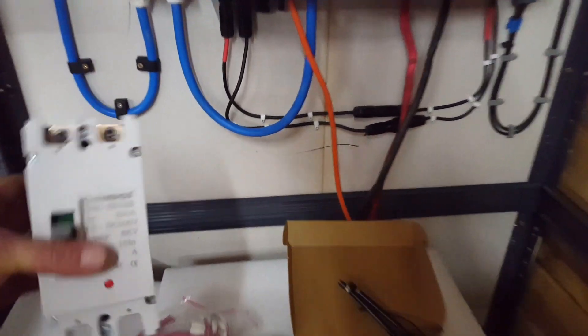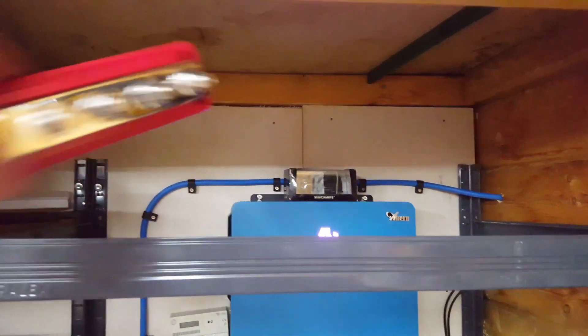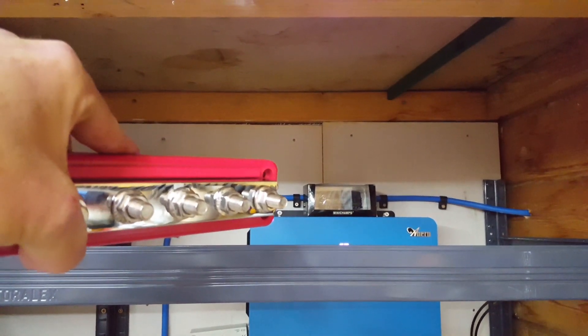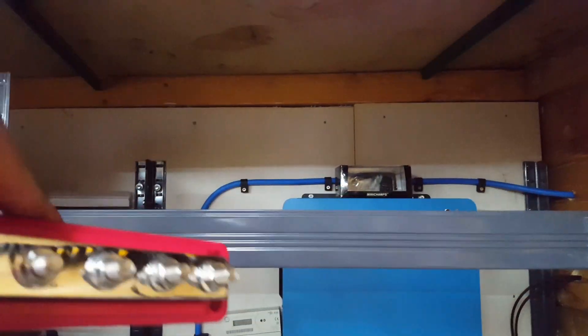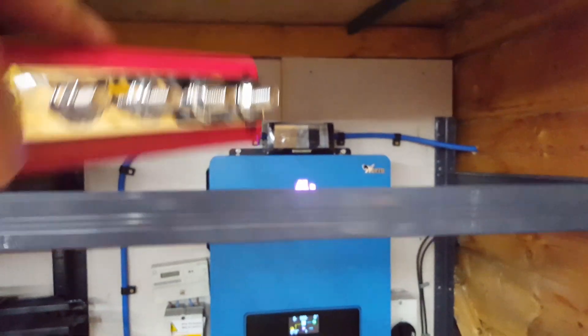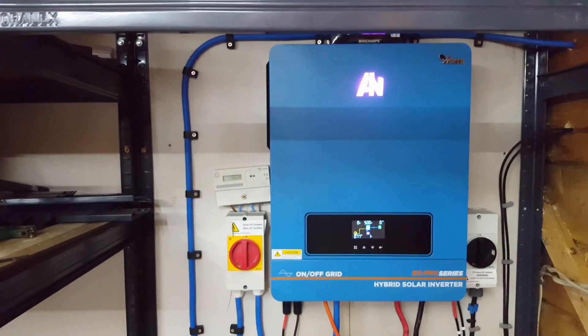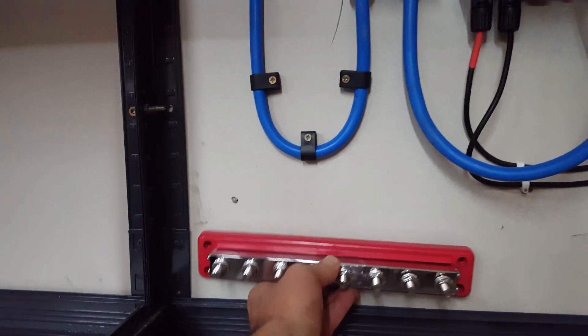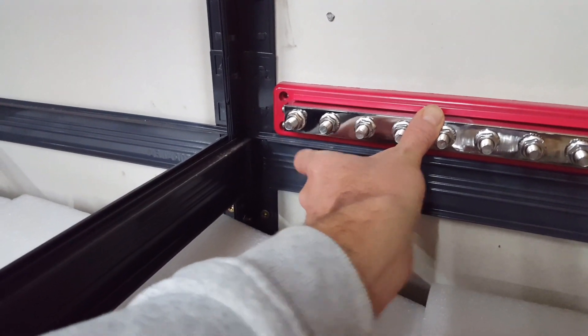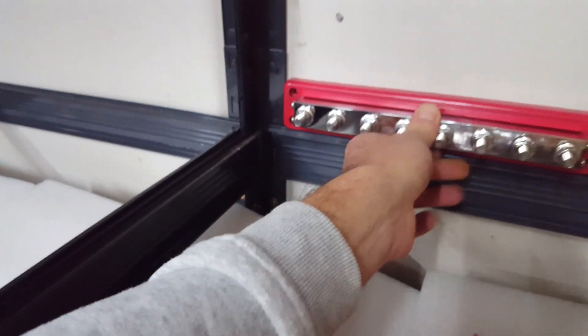There's not an awful lot of room for things. In the manual it mentioned having minimum clearances all the way around the inverter for ventilation — it doesn't really get hot on top, the sides draw air, and the bottom blows air. So I can probably shift the inverter and switches up a little bit to give more space. The bus bar studs take it out past the metal frame of the shelving, so the bus bars could go right down tight against there.